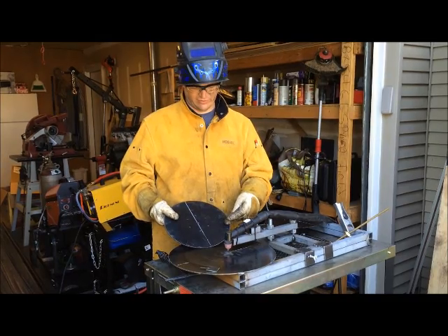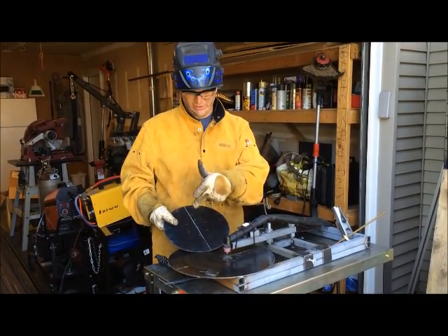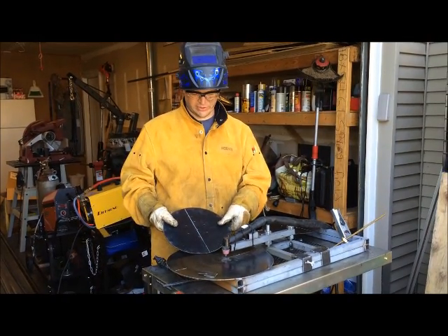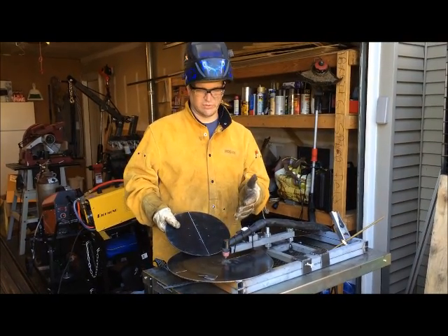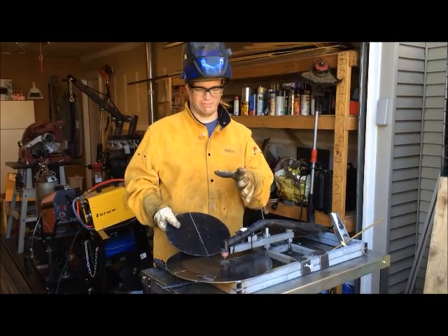The radius is five and three eighths. Unfortunately, my drill press from the back column to the center of the spindle is only five inches, so I couldn't use my drill press to drill these holes with a hole saw. Not only that, but my drill press wouldn't go down to the required RPM — it's like 150 RPM for that big of a hole saw.